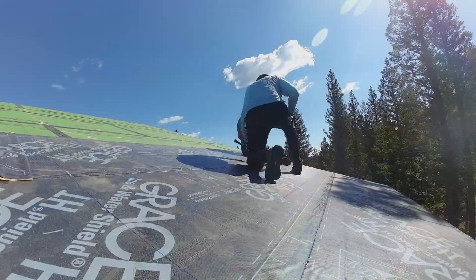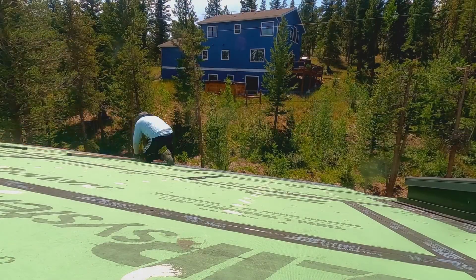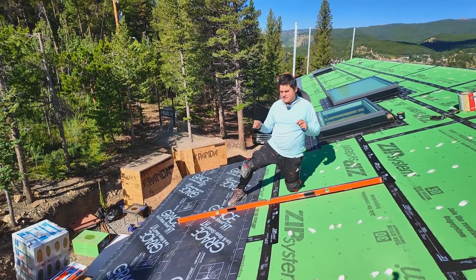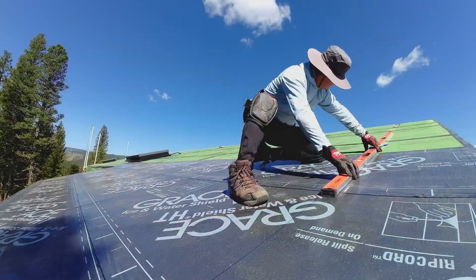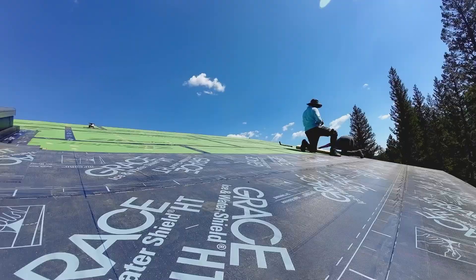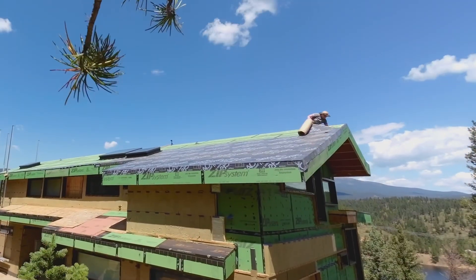I'm in the process of marking all my rafters. A marker would be ideal but I just don't have one right now. The reason I'm doing this is because we're going to be installing a solar roof from SunStyle — a super beautiful roof, I highly recommend you check that video out when it comes out. Imagine being a roofer showing up and the entire roof is covered in ice and water shield with no idea where the rafters are — you'd be poking holes everywhere. So that's the key thing about thinking ahead and marking things for the next trade.